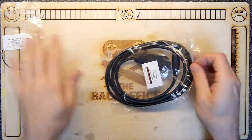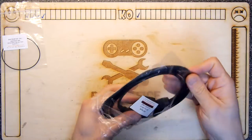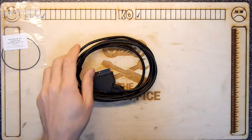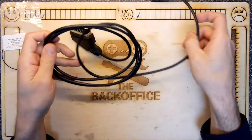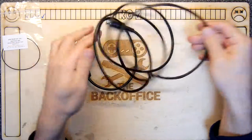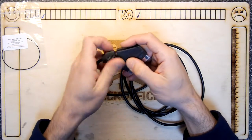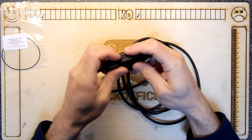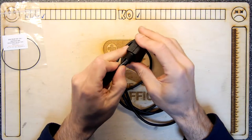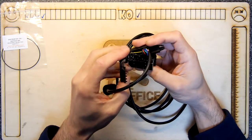Coolnovelties.co.uk. But I'm more interested in the RGB lead, because RGB leads, of course, can differ in their quality. But look at that, RGB to SCART connection. Looks plenty long. I'm not going to measure that, but yeah, plenty long. But always open up the back shell, have a little looksy inside, see what's in there, because often there's additional components required, like resistors and whatnot.